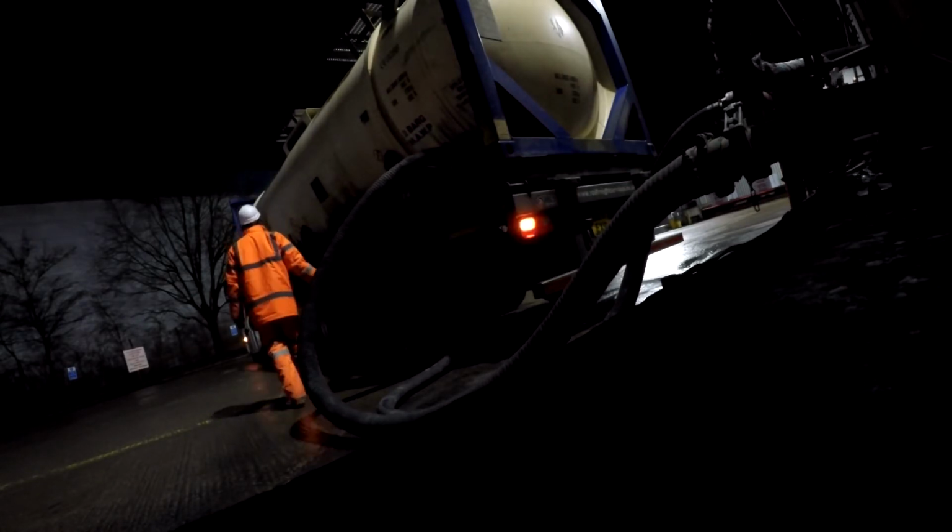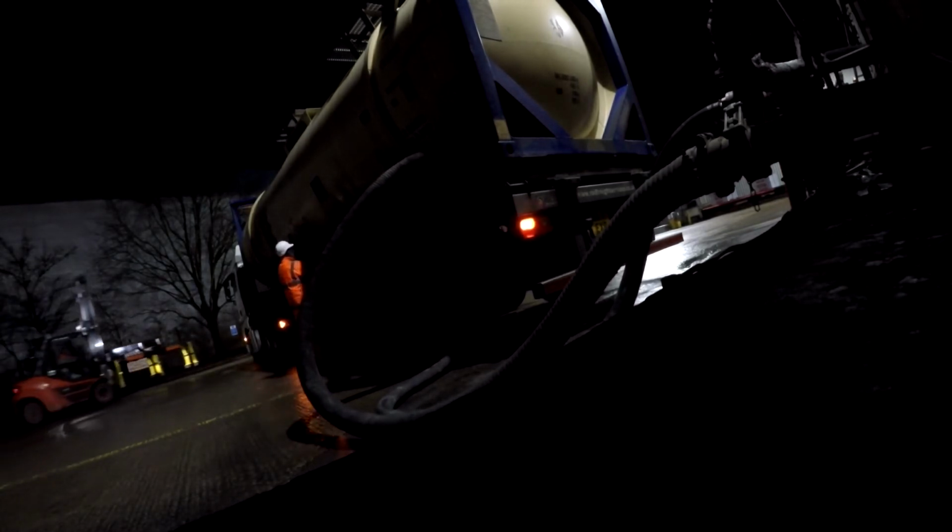So you can see there the pipe is jumping around quite a lot. That's usually a good sign that the middle section of the tank is starting to run low on powder, because during that phase, powder from the front and the back of the trailer will have been collapsing into the middle, so it doesn't just run out point blank, it sort of stutters and starts. And the pressure does slowly drop inside the tank, which it has done.